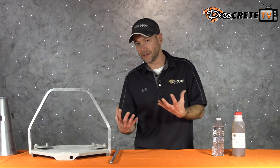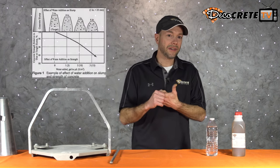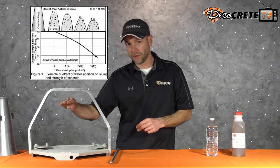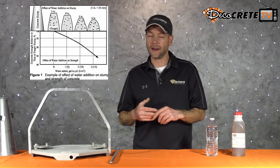You're always going to order your concrete to come to the job site at a certain slump, and when it gets there it's rarely exactly the way you want it. The first thing you can do is add a little bit of water. The general rule is that adding one gallon of water per yard of concrete will bring the slump up one inch. So if you know you have one yard at a four-inch slump and you add one gallon, you'll have a five-inch slump — you can use that formula based on how many yards are in your truck.